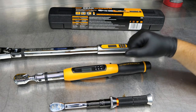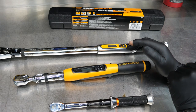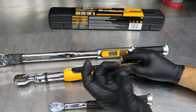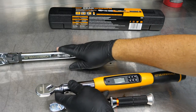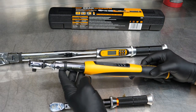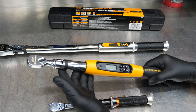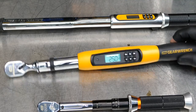We've got plenty of dial-style torque wrenches around here where you can actually watch the needle sweep, and some people like those — but I prefer to have an electronic torque wrench with it built in. Because pretty much all manufacturers have gone to torque-to-yield fasteners, requiring you to have that angle either in your torque wrench or as an additional dial on the anvil. Now this has got a 72-tooth design; the 120 XP is 120 teeth and this one is 72 teeth, so we get five degrees of swing arc — a little less than double the swing arc of that model. But on a torque wrench, typically we're not in really tight areas, so that shouldn't really give you a problem, and the 72-tooth design should be a little bit stronger as well.